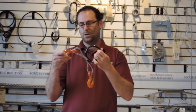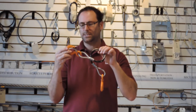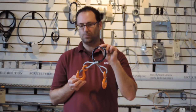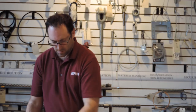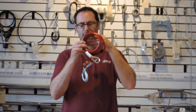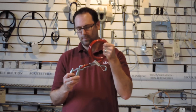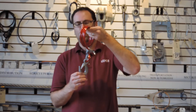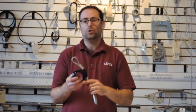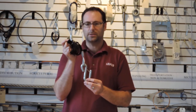On this trailer safety hook assembly, there's a hook on both ends. Here you'll see a painted eye hoist hook, and this one does not have thimbles in the loops. Here's another example where there are thimbles in the loops but the loops are coated — this is for a lower strength application — and we've got an eye hoist hook on one loop. I showed you S hooks earlier, and here's that S hook with a latch attached to the trailer safety cable.